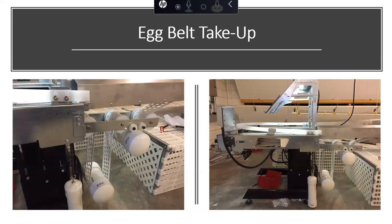What we've chosen to do is automate that take-up system and put it in the control room with your egg table. Some competitors have chosen to do it manually or at the end of the house, but we feel that take-up system needs to be in the control room where the grower is spending all his time monitoring the system. This take-up is probably one of the key features in selling this nest. Our table is also second to none in the breeder industry — heavier, more robust — key for keeping belts lined up and tracking properly.